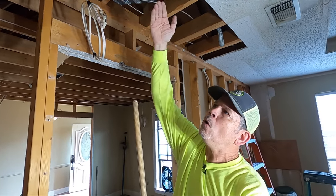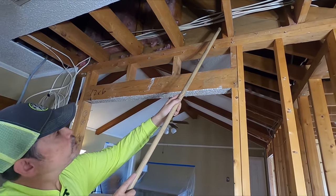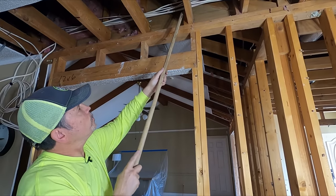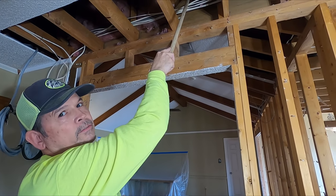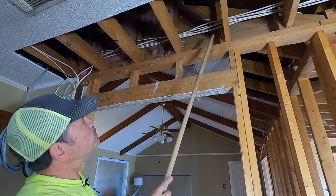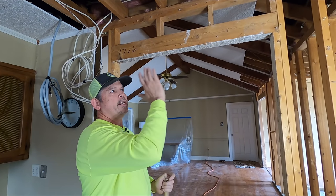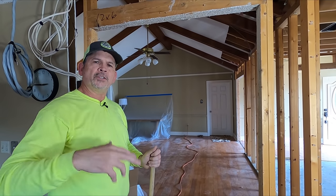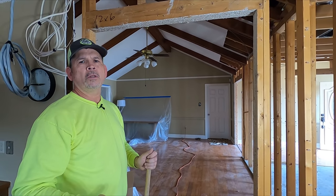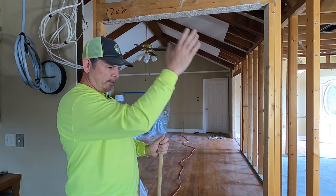That temporary wall will also support the roof load coming down on those two braces — we're just going to swing those over to the new wall. Over here we have these short two-by-fours. These blocks are nailed to the double top plate and to our rafter for our cathedral ceiling, and we're just going to remove them because they're only acting as drywall blocking. So we are ready to build this wall. I picked up all the eight-foot studs this morning, and all the bigger stuff is being delivered tomorrow by our local lumber company. Let's get our tools and get this wall built.